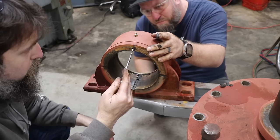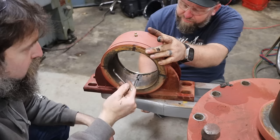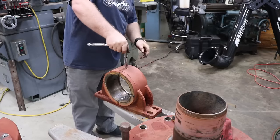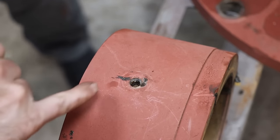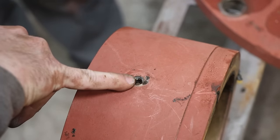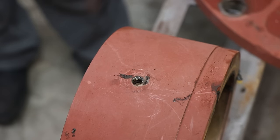Yeah, it looks like this bushing has probably been run dry, and it's twisted this bush in the housing. I don't see any way that this bush is anchored to this housing. Solid. Yep, so this bush has rotated in the housing and it's no longer aligned. There is a hole in the bush, but where it's rotated, you can't get any grease in. So that's one reason why I had to pull this apart, because that seemed odd to the gentleman who owns this.